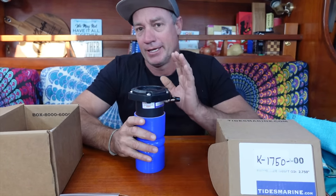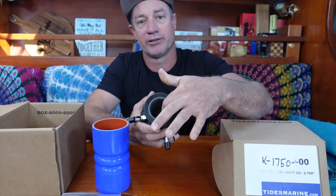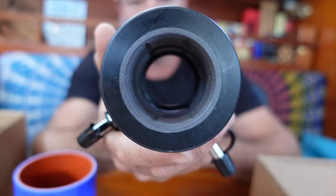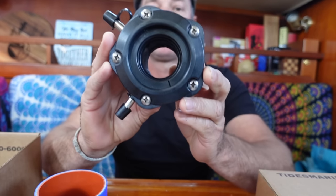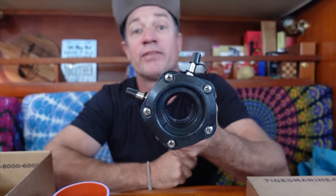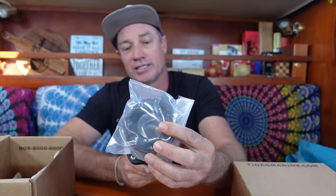In the process of changing the seal — which we're about to find out — we'll see how much water comes through this seal as opposed to the PSS seal on the boat. As you can see here, it's almost like a cutlass bearing. There's not much room around the shaft apart from a few slots to let water through, so even with the seal removed, there isn't going to be a great deal of water coming out. It's personal preference — I'm going to give this one a go. I love the redundancy of having a spare seal.